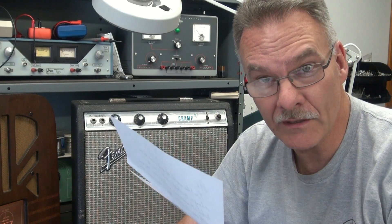It came to me from a fellow in Texas. It's been through a couple of shops and they haven't been able to figure out the problem. He says the problem with the amp is the volume — it changes by itself, sometimes louder, sometimes softer. When it happens, he hits it on the top and the volume changes. He also states that the 12AX7 and 6V6 are new. So what I'm going to do is pull the chassis, put a scope on it or possibly a vacuum tube voltmeter, and see if we can watch these changes in level and find either a bad connection or it could be a bad tube.